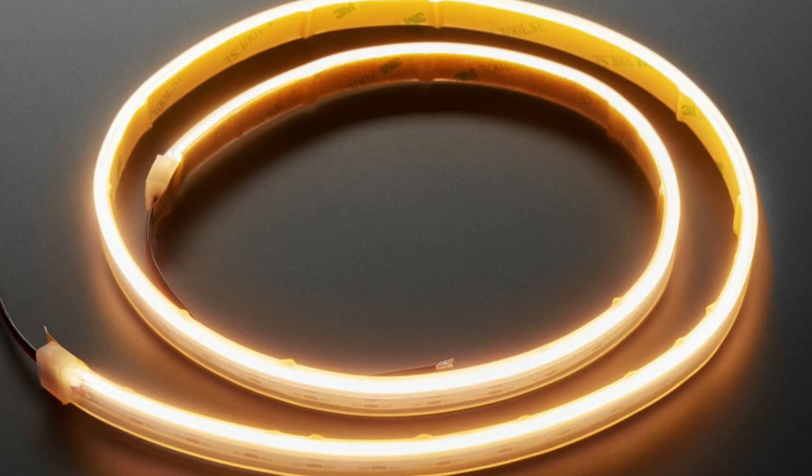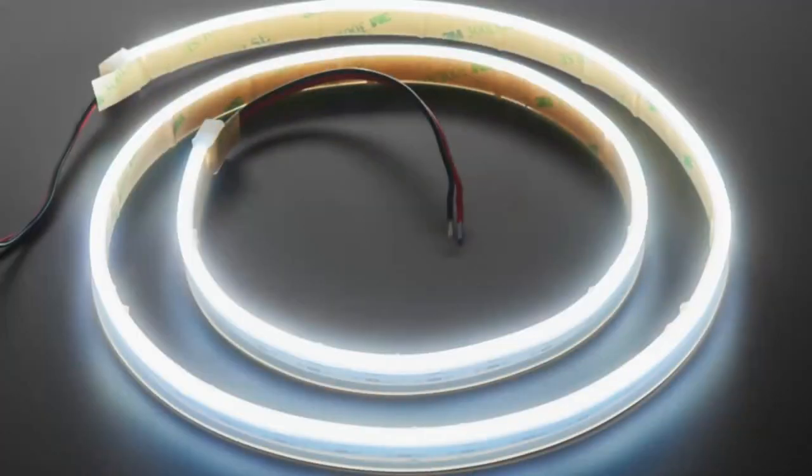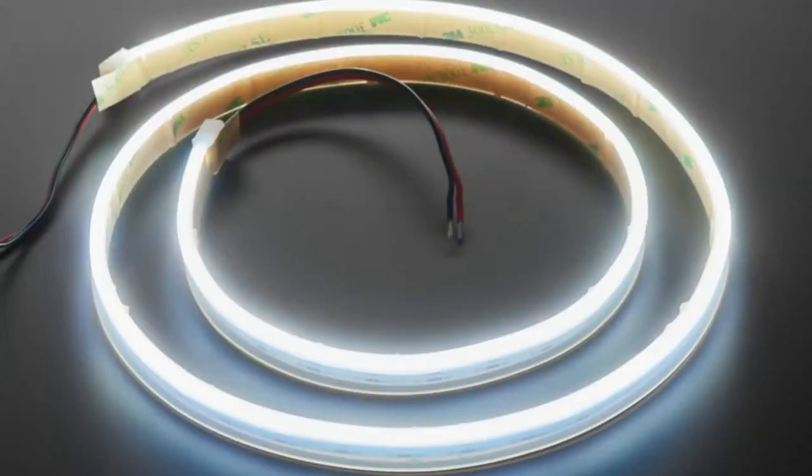Next week we'll have RGB as well. Just as a note — it's all one LED, like one big light. As you power it, the whole thing lights up. It's not addressable; you can't animate individual pixels. It's one ginormous LED that you drive at 12 volts.